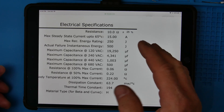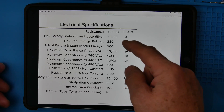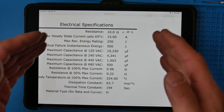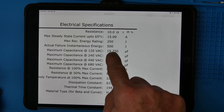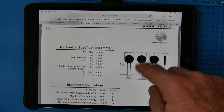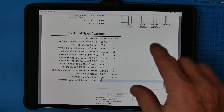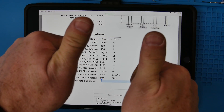If you're limiting your inrush current — like with an inductor in series with capacitors — then you won't have as much energy. And if you size this part big enough, you don't have to worry about this as much because you're never pushing it to 250 joules. In my 'Designing with Thermistors' section I go over this in more detail and have a quick-reference sheet showing the math and calculations. Hey, thanks — if you liked this, give me a thumbs up!